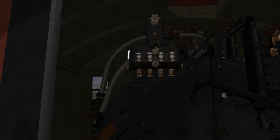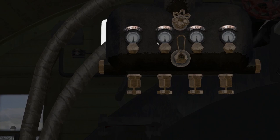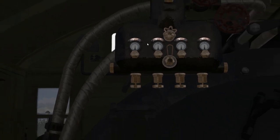What this does is it takes these little drops of oil. As you can see, they're coming through here. It takes very little drops of oil, and you can adjust the flow right down here. And it puts it into steam as it's going through, or water. And that steam goes into the various cylinders. You can see this left-hand valve, left-hand cylinder, right-hand valve, right-hand cylinder. And it sprays out like a spider web, and it coats the inside of everything. It's kind of interesting that somebody was able to come up with this.